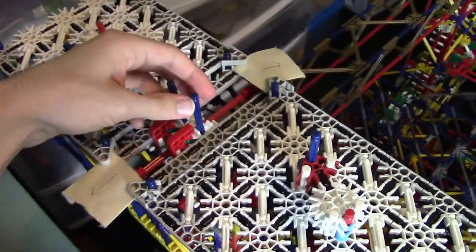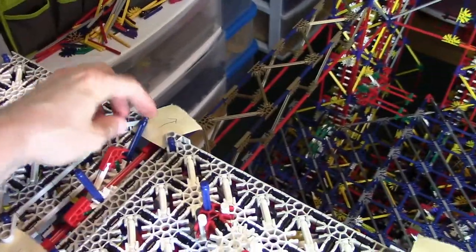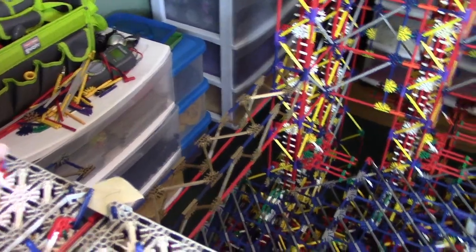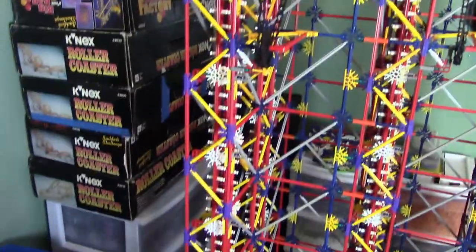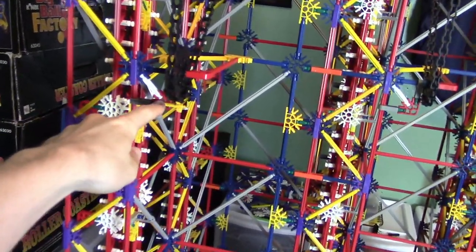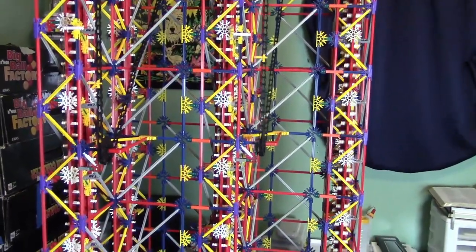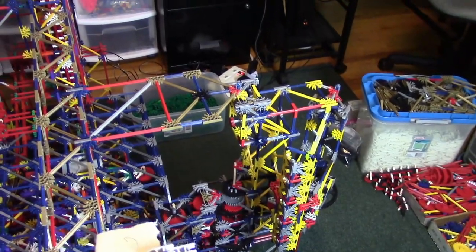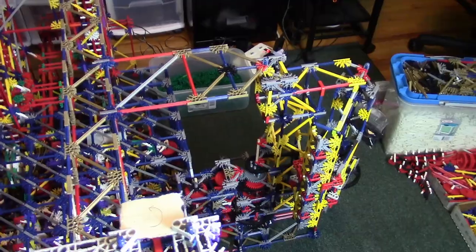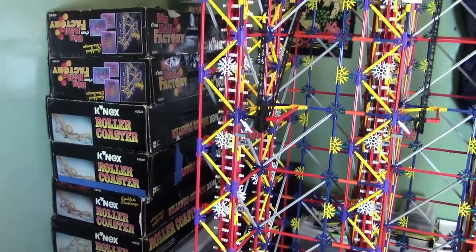Next let's make the third joint go up. So we will just push both these levers like that — sometimes you need to jiggle the crank a little bit just so that lever goes all the way. Then I can crank this tape and there goes the third joint. You have to be mindful when you are cranking the tape because that tape difference gauge has gone all the way down to the bottom, so I need to start doing the other joints in order to keep everything from going too far. So I can put this one back to neutral and move that back to the middle.